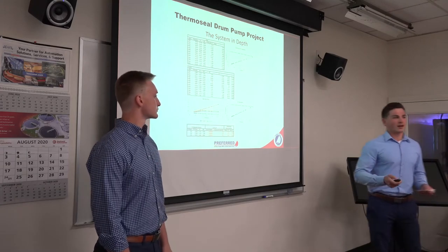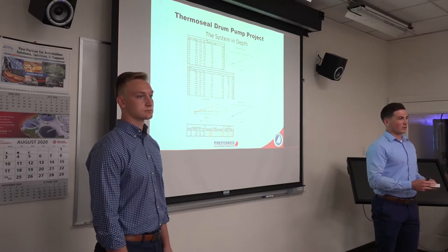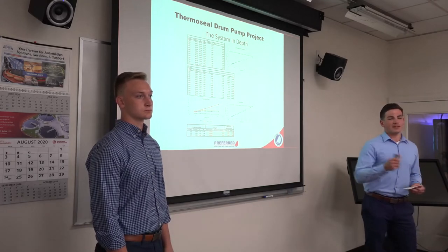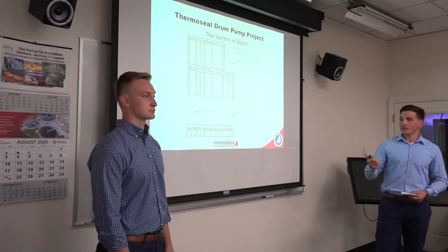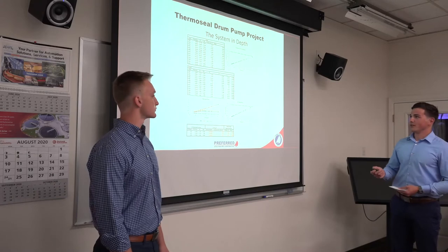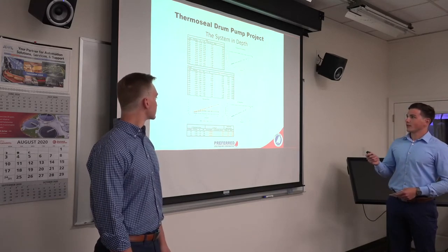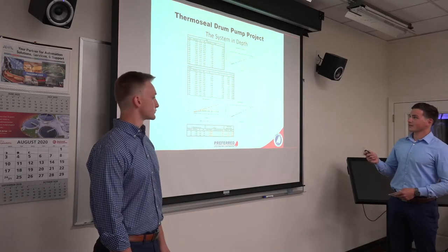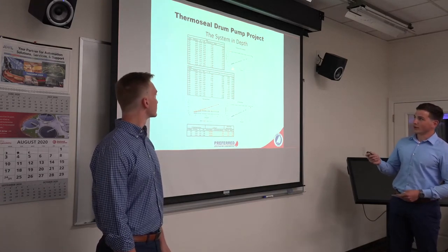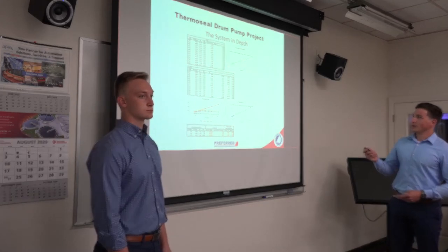To figure out exactly what had to happen for the designs, and to find the dimensions required to get the right compression squeeze for these ports, I took the data from the Parker Hannifin handbook and put it in an Excel file. I took the O-ring inner diameter and plotted it against the groove outer diameter, and I noticed that there was a linear trend line between the two.